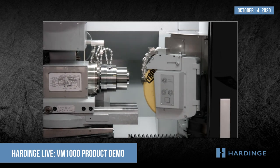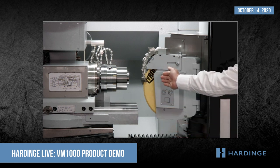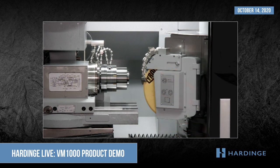The modular construction of the turret wheel head allows the four grinding spindle positions to be specified individually. The external grinding spindle has a power of 12.7 kilowatt. The speed is variable, adjustable from 400 to 6000 RPM. An external grinding wheel up to a diameter of 300 millimeters and a width of 40 millimeters can be mounted.